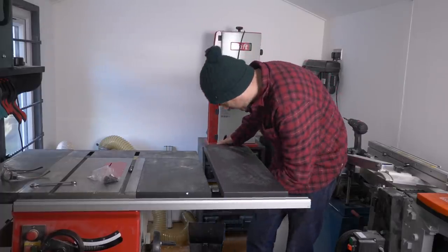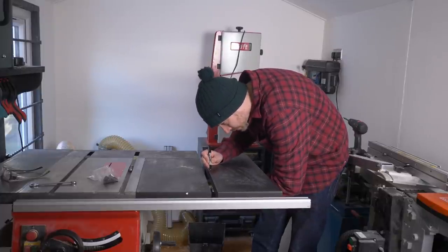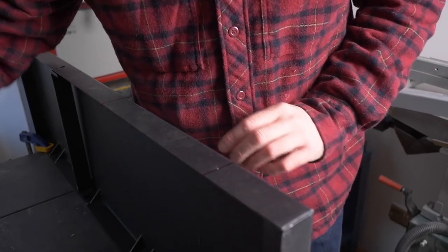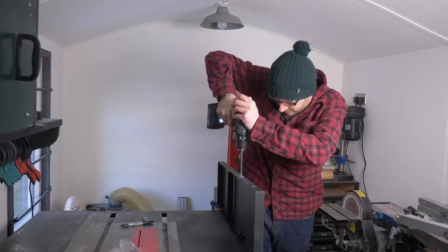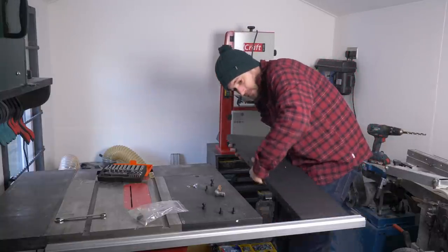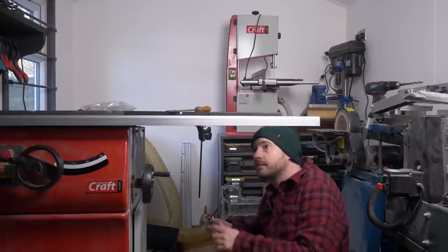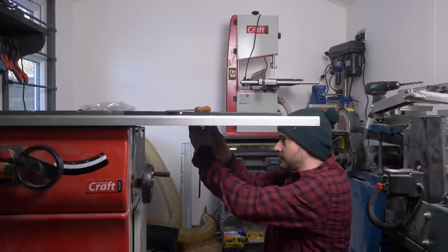The new wing comes with pre-drilled holes but they're on the wrong side, and I can't just flip it around because it's got the mounting holes for the fence at the front. So I mark out where the holes need to go, punch the position, and drill them out. I get the supplied bolts through the freshly drilled holes and into the existing wing. Washers and nuts go on the other side and I tighten it all up. There are also a couple of holes at the front to get bolts into and lock it down to the fence.